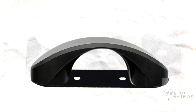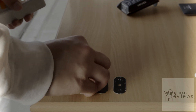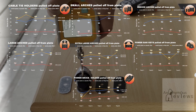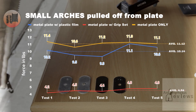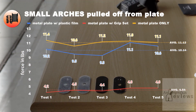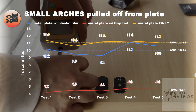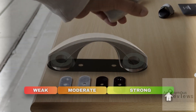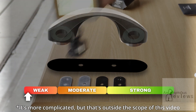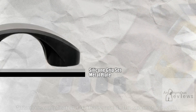What was surprising was the discovery that the grip set fared only slightly better than the bare metal plate. In order to help provide an explanation for this, we will first have to observe general trend data from the pull-off tests. The pull-off tests showed that the metal plate alone offers the most magnetic attractive force, followed closely by the plastic film, and then the grip set at a distant third. Intuitively, this makes sense because magnetic attraction weakens the further magnetic objects are placed from each other, and whenever you add a layer — however thin — it increases the distance between those objects.